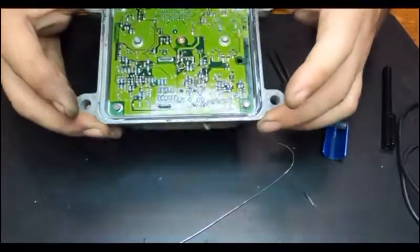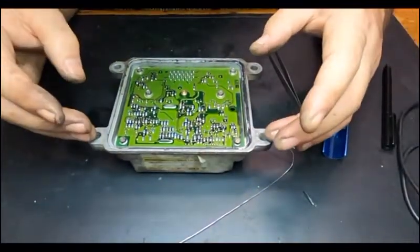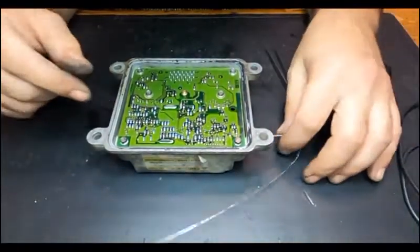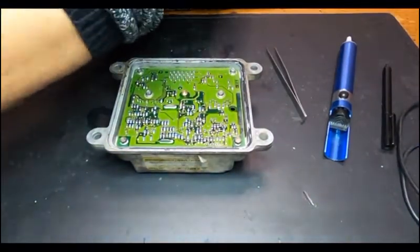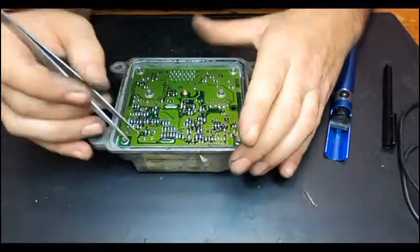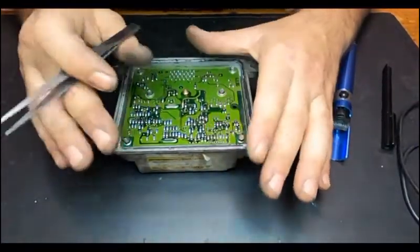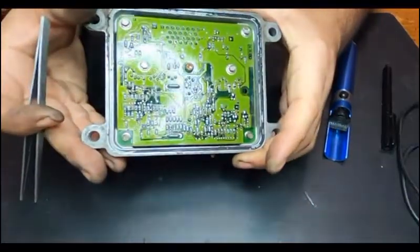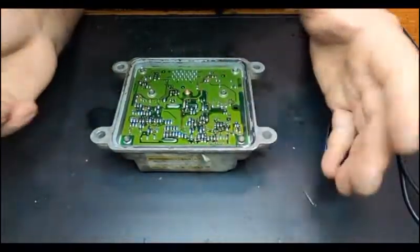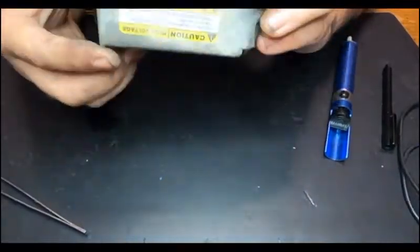This takes the signals from the MAF sensor, the intake pressure sensor, the RPM, the throttle pedal position, everything, and calculates the right amount of fuel to send to the engine. If this is not working properly, then that's what happens. The injection just gets really, really hard. It can even destroy a piston if you just leave it as it is.